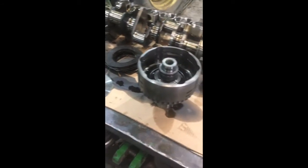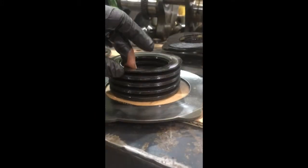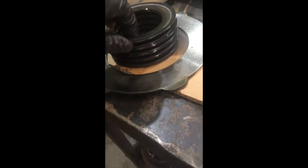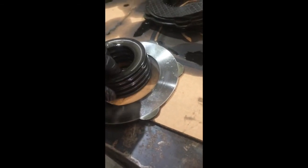Got all our new parts, we're ready to go back together. Still working on getting this piston out. After the snap ring, you remove all the springs — the snap ring goes right above all these springs. They're little ring springs that look like five long washers. Depress those springs down, take that snap ring off. The next part down is the piston — you can see that little bit of rubber there. That piston failed, which is probably what caused this whole mess.